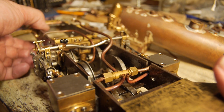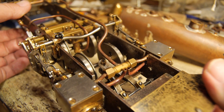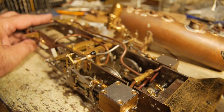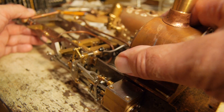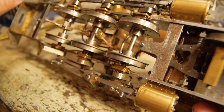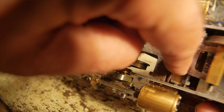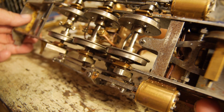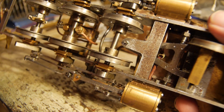The problem here was getting to these pieces in the exhaust and live steam passageways so that I could actually put it together. If I put the smoke box on, it's going to be quite difficult to get at these pieces — there's a frame stretcher here and a front bogey. The exhaust passages you can just about see down there through the bogey and the frame stretcher, so I can't get a wrench or spanner in. It's all pretty tight.